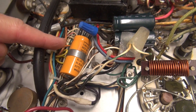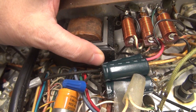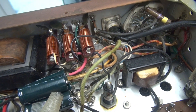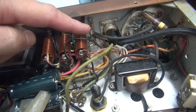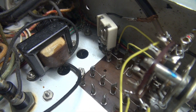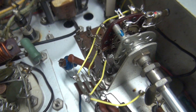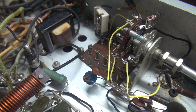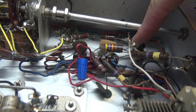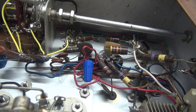Here's another dual cap that's been replaced. The choke I believe has been replaced because it's missing a screw and there's a wire nut going to it. Over here it appears the AC cord has been replaced. There's some electrical tape on the VFO cable coming in, which goes to a capacitor off the ground, and there's also some other kind of magic going on — I think somebody is trying to slide the frequency around on it. Over here I noticed a couple of resistors — there are like three of them in series with a little hanging pigtail.